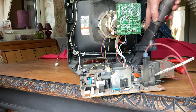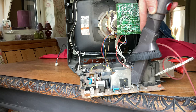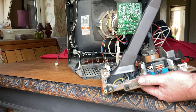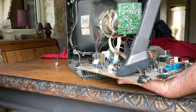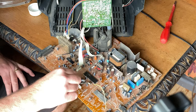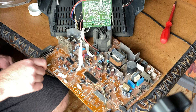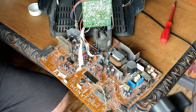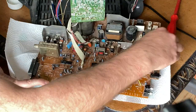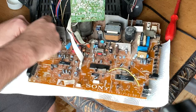Disconnect everything and remove surface dirt — grab a vacuum, and as long as everything is earthed and turned off you're not creating any static electricity. Don't push hard or bend anything, just get as much surface dirt off as possible. Then use white spirit — turpentine or anything alcohol-based — to clean the PCB surface. Use an earbud or cotton wool bud for intricate areas, but for a really dirty board like this, use a good quality kitchen towel dipped in turps and wipe it all over. It takes about 30-40 minutes to get it clean enough for the next stage.